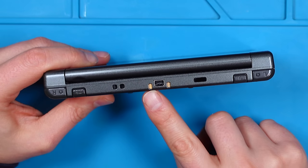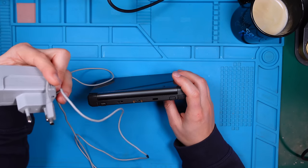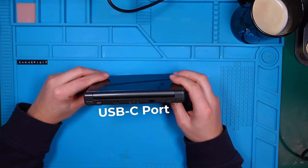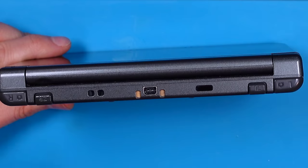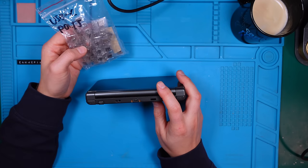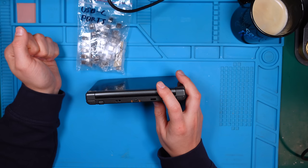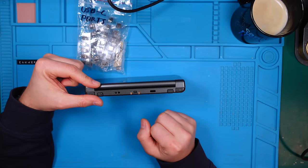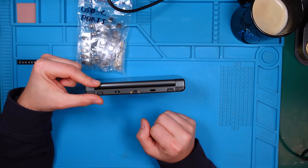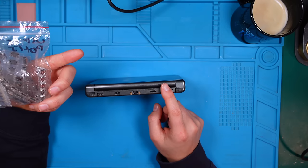We have this nice port and we would need to get this in our back if we want to charge this little thing, and I don't think that's a good thing. We want a USB-C port in this, which means we need to get rid of this and modify our case to fit a USB-C port. I don't want to use a complete mod board - I'll look at which USB-C port could fit best, put it in here nicely without too much hot glue, hopefully no glue at all. Maybe design a little 3D printable board to mount it. We'll have a look and see how it's working.